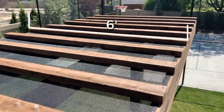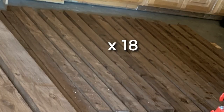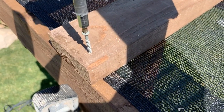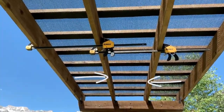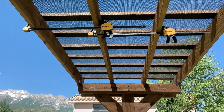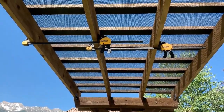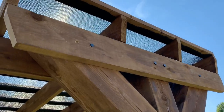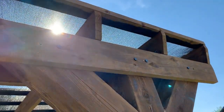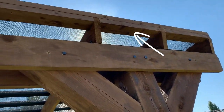Now it's time to cut the top boards. These are 2x4s, 6 feet long, and you need 18 of them. Take 16 of those and space them out evenly along the top. Make sure they're all straight with each other and then screw them in with 3-inch wood screws. Before you screw down into the middle two long supports, look underneath and make sure they're straight, as these long boards have a tendency to bow. At the last minute I also decided to cut some pieces of 2x4 and slide them in at the ends where you can see the cut edge of the screen — it makes that area look more finished.